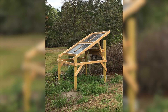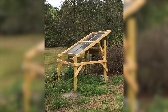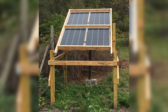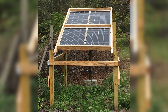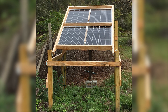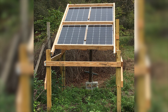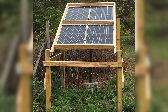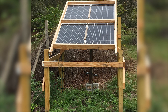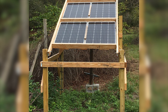This next one is a little trickier to diagnose. When we first looked at the solar panel mount, it looked like we weren't casting shadows. But when we looked at a steeper angle, we noticed the 2x4 sticking up about an inch and a half over the solar panels, casting a shadow along the entire edge of the array — both at the bottom two panels and the top two panels. It was just a small strip covering those solar cells, but since they're all in series, that current-limited the rest of the array and significantly reduced water production. He just had to cut those 2x4s down so they weren't shadowing the bottom of the solar cells.